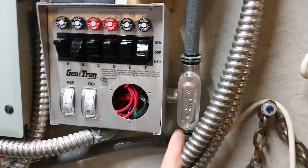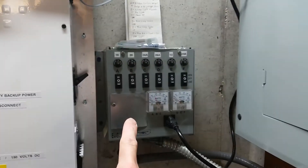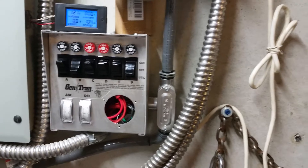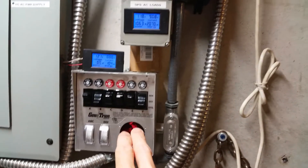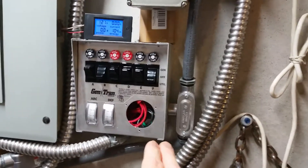There are three wires here because the other wires are going to this other box right here. I'd prefer to have both coming from here, but it's only 10-gauge wire coming down through here, and 4,000 watts is 33 amps, so it's a little over that. The power feed coming from the inverter is 8-gauge wire into this box, and then I've got 10-gauge coming from here, so that's kind of a weak spot in the system I need to remedy at some point.